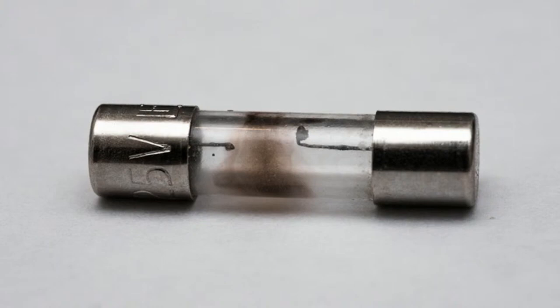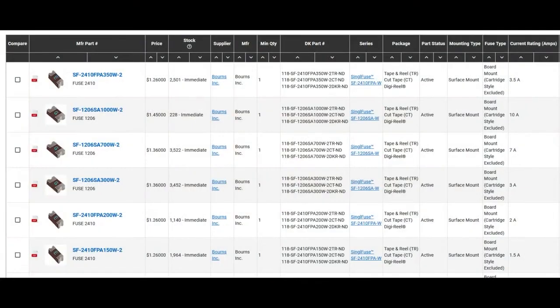These are self-healing because as the short goes away, the circuit is open, the PTC will slowly cool down and then reclose again, basically retrying later. I do want to mention, Bourns does have some one-time fuses that are surface mountable, so just watch out — I think they're called one shots. But these are the PTC resettable ones I'm talking about.